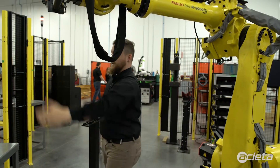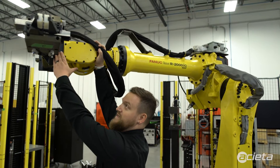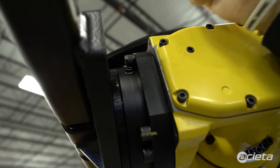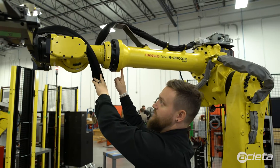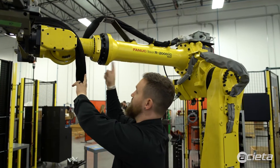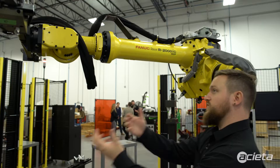Coming to this side of the R2000 165, here is the J6 outlet located on the top. When you push grease from this point, the other two outlets I mentioned are this point here and this point here. You can pull this outlet port and push grease from here through the wrist and out this port.